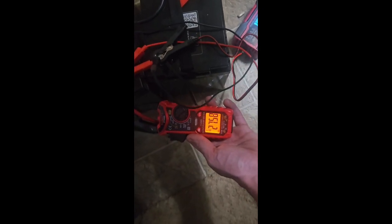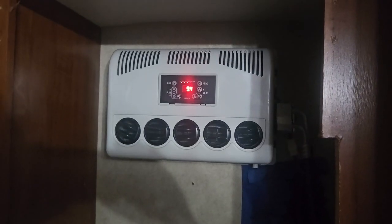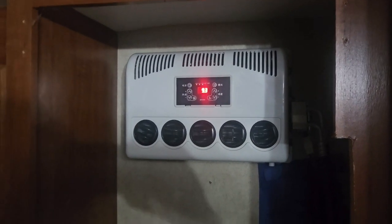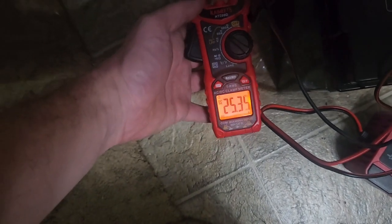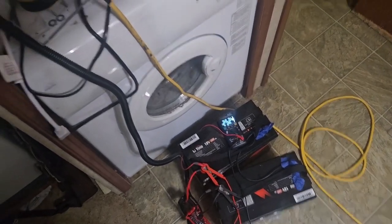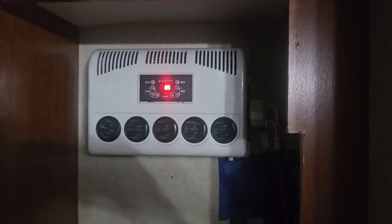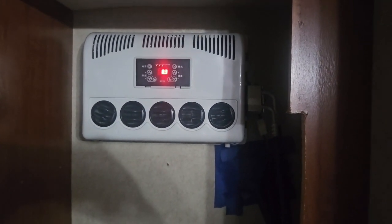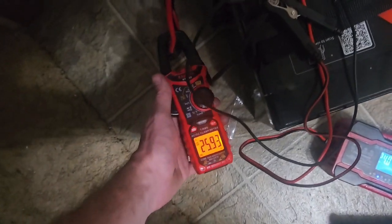After fully charging, the pressures look correct — about 30 amps, a little less. It's working great. At full power we're sitting at about 27 amps, pulling down slightly but probably going back up. The propane-isobutane blend definitely made a difference — the COP went up about 0.5, from 4.5 to 5.0. At 70 degrees it's right there; at 72 it starts getting a little dicey. Not bad — right now it's 71 degrees outside so the COP is about five.